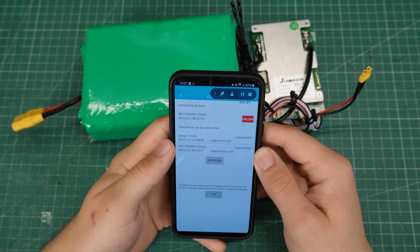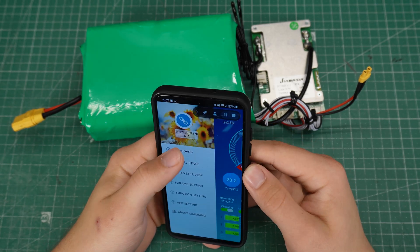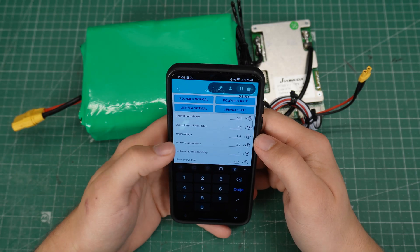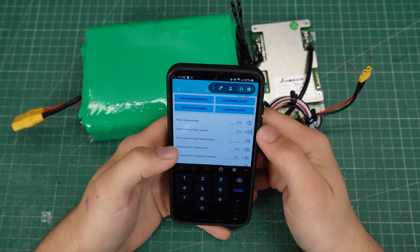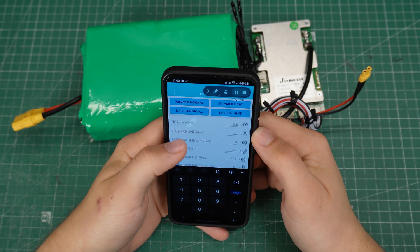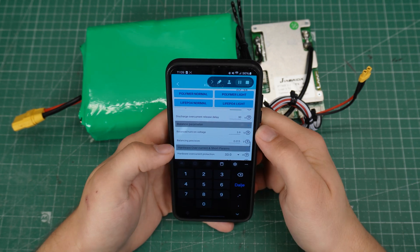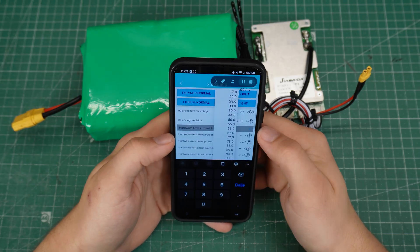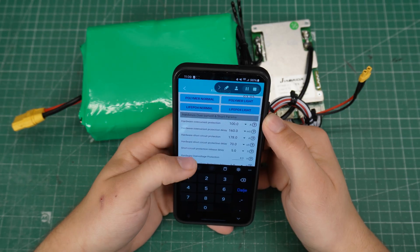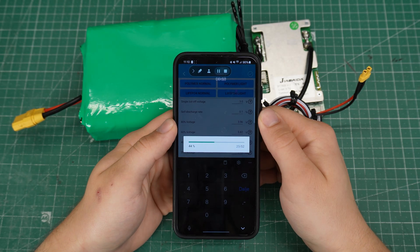Now comes the other fun part, and it's the BMS Bluetooth settings. I will leave a link to the official app and some alternatives in the description. When I first connected to the BMS, I went over all of the voltages again to confirm that everything was as expected. Then I went into the parameter settings and I changed the output current limits so that the BMS doesn't trip when I accelerate. Make sure you keep these values close to your real currents, because if you put 1000 Amps for the output current, the BMS will trigger at something much lower, like 30 Amps. I did have this problem with my first battery pack - I wanted to get rid of the over current protection and I set it too high at something like 1000 Amps, and after I flashed it the BMS triggered at around 30 Amps. It took me a few days to figure out that this setting was corrupted since I put a number that was too high.